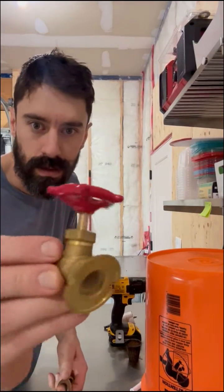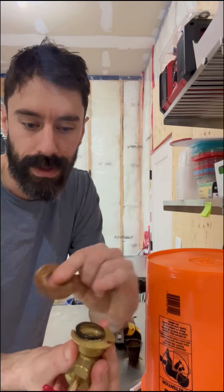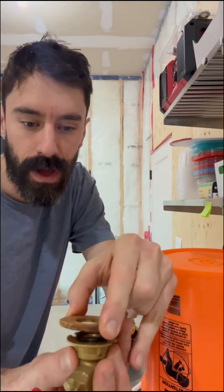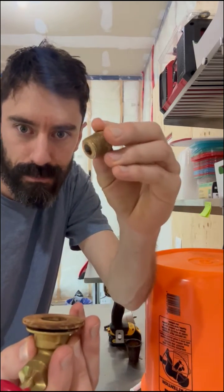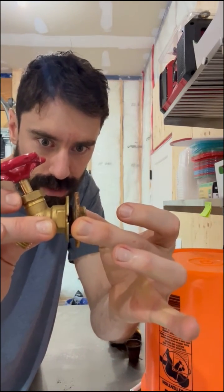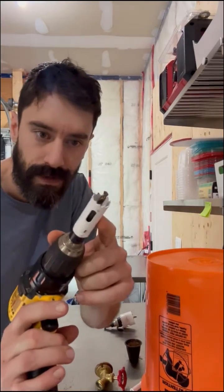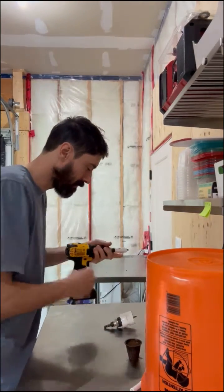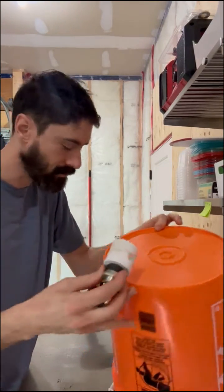Let's look at what you will need. You'll need a tap — just a regular garden hose tap; inside is a half-inch thread. You're going to want to add an O-ring, which you can find in the plumbing section, and a washer from the nut and bolt section. You want the inside of your nut to be at least half-inch so that your half-inch to quarter-inch reducer fits and screws inside. Your bucket will be squeezed in between the washer and the nut. You'll also need a five-eighths drill bit to drill the hole in your bucket, and a two-inch hole saw to cut a hole in the middle of your bucket.